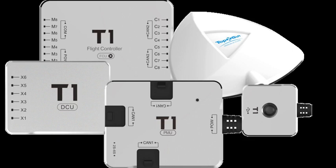Connections: Fix the flight controller board on the UAV hub — the arrow should indicate the forward direction of the UAV. Fix the GPS module firmly on the UAV — arrow should also indicate the forward direction. Connect the LED indicator, GPS module, and DCU into the power module unit to supply power. Connect the power module unit into the flight controller board via any COM port and the POW port to send instructions to other elements.